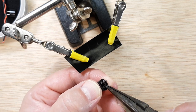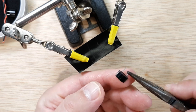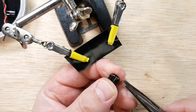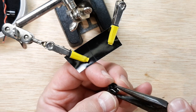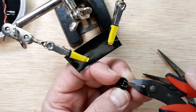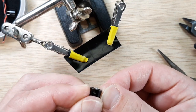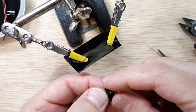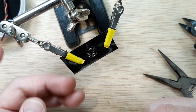Sticking it to the black tape makes it easier to solder. Before we solder, we just want to bend these leads a little bit. I'm using smooth-jawed pliers - no teeth. We're just going to bend our leads over. Just be careful not to bend them too quickly because they'll break off. We have them bent over all the way. Imagine the size of a solder pad - that's basically how much you're going to leave behind, roughly about the size of a solder pad. The positive 5V side goes away from me and the negative side towards me.